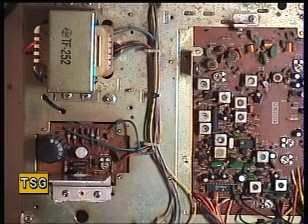The set has also come with all the screws bar two in, and the rest of the screws in a paper bag inside — so it's been looked at. Just switching it on, I've got some very strangled audio. So we've either got some capacitors down in the audio section, or the audio IC is about at it. We'll see whether we can set the VCO and take it from there.